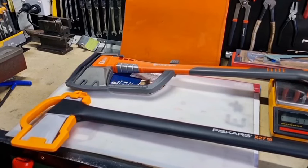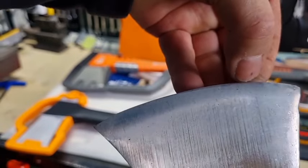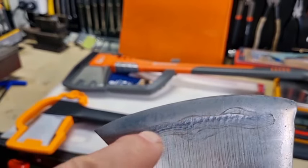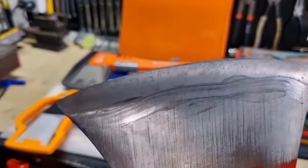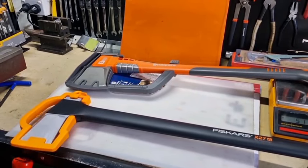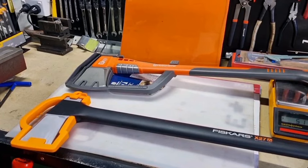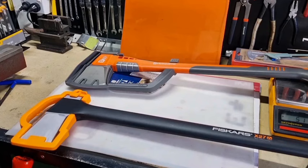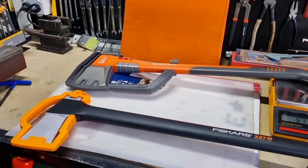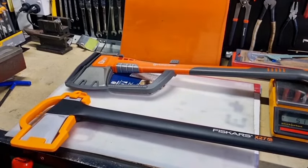Being 85 degrees, the beveled edge was only about two and a half millimetres. Now the bevel edge is about eight millimetres — if you run your finger along there you can feel it. I always put oil on them so they don't rust. That beveled angle of about eight millimetres really does work well and splits timber much better. A lot of people say you don't need it to be sharp, but that's not exactly true.